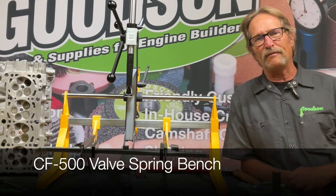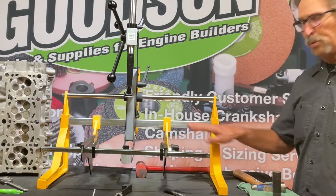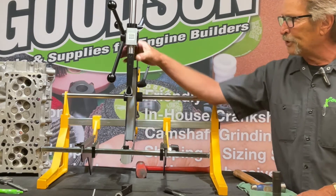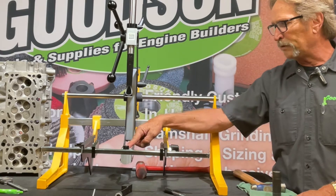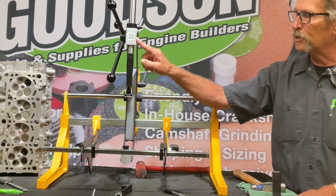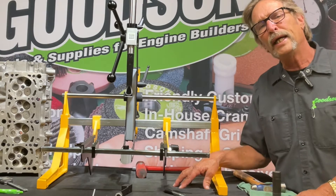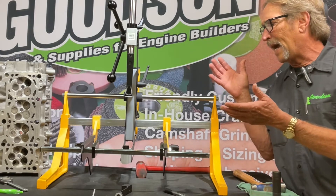Richard is not new to this company — he's been with us for over 20 years, worn a lot of hats, and worked in just about every department. Proud to have him as part of my Tech Lab Tuesday team. I wanted to start this first episode with a recap of the CF 500 spring bench. Some of the manufacturing characteristics have changed. It's all aluminum casting poured into a sand-type mold, but now they've added strap steel which gives us a lot more rigidity in vertical pressure. They've also gone to aluminum block material for the press foot housing and the rack and pinion enclosure.